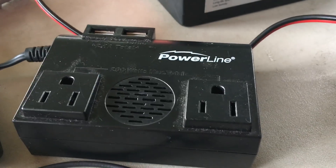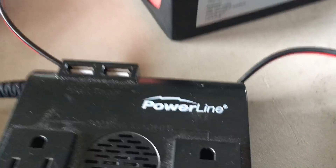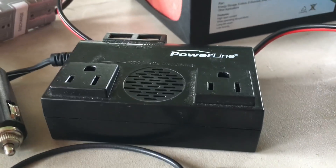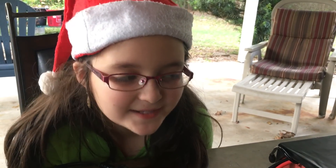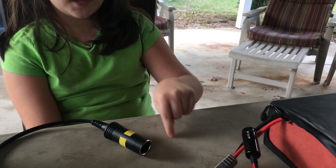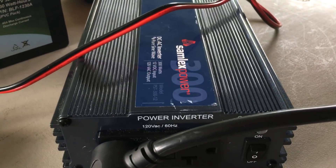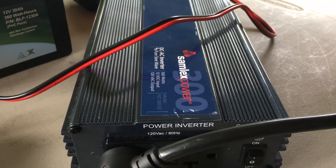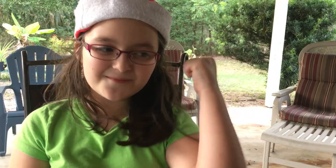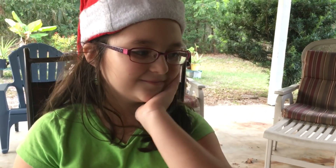We tried this one we got from Walmart, made by Powerline — it says 200 watts maximum — and it had a really trashy looking square wave on it. Would you rather have a rectangle head with a tuft of hair or a rounder head? I'd rather have the rounder head. That's one way to look at it when you're 9. We have the Samlex inverter, which gave us virtually a pure sine wave right at about 60 hertz. So which one do we want to plug in our MacBook Pro, which costs $4,000? The Samlex one. Bigger the better. 73.